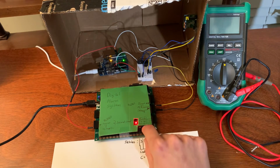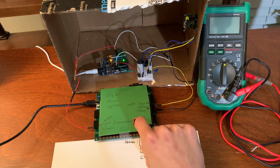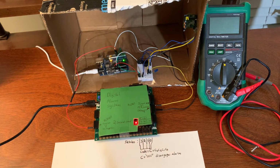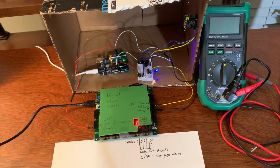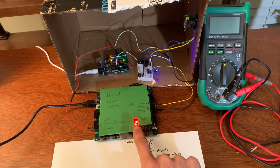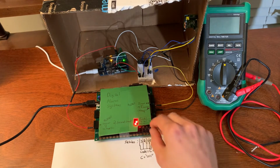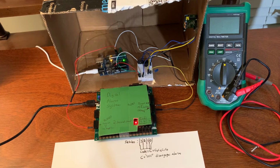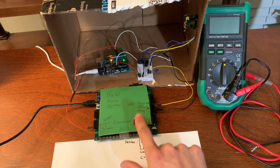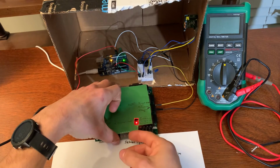Here, I will show it again with 1101, or let's do it with 1001. So if we have 1101 and motion is detected, you saw that the counter counts up and that the buzzer rings until the correct code is implemented. There's only one other way to disengage that buzzer, and an intruder would not be smart enough to do it.